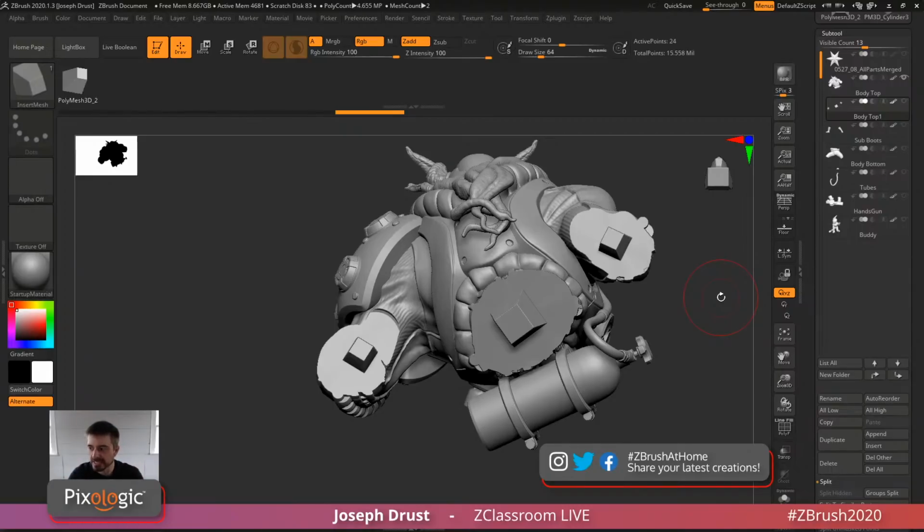And so if you have a key that's a square and equal on all sides, that key can still fit in that hole at a different angle. So it's not only fitting the hole one way, it can fit the hole at least 4 ways. So sometimes that's bad, especially if you're trying to get precise alignments on objects.